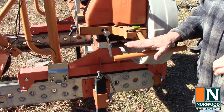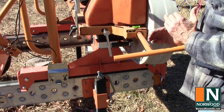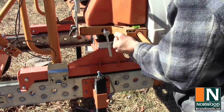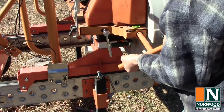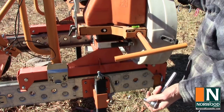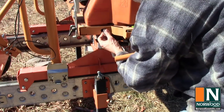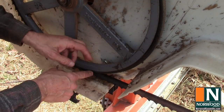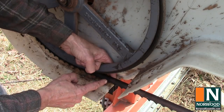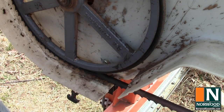When you set your tracking, you want to make sure you have your blade up to full tension. There are some mills — and the HD 36 is one of them — where as you change your tension, it's going to change your tracking a little bit. So you can't do it with a loose blade. We need to torque it down to about the tension recommended by the manufacturer. On this mill, we've got the tracking screw right here. You've got tracking on both band wheels, so I'm going to show you for one, but you need to get them both to be the same. What I'm looking for is to have the body of the blade — the part between the bottom of the gullet and the back side of the band — pretty well centered on the pulley. You need to do that on both sides, and if you do, it should ride pretty level.